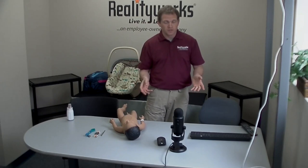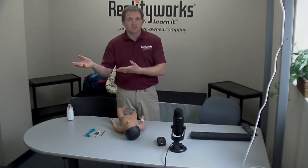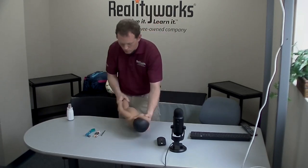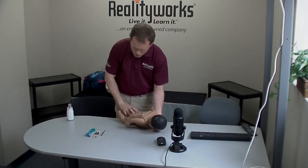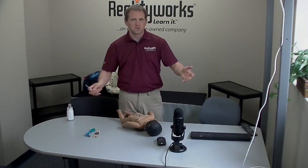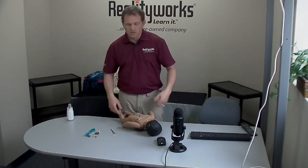So let's say you have a baby that is not making any sound. You've run the test but no noise was made as you were putting the bottle to the lips — no chiming, no growl sounds, nothing as you're running the test. Or let's say you push down on the button that's above the red light and no chime is made, but it is communicating with the control center. That's an indication that the speaker is not functioning.